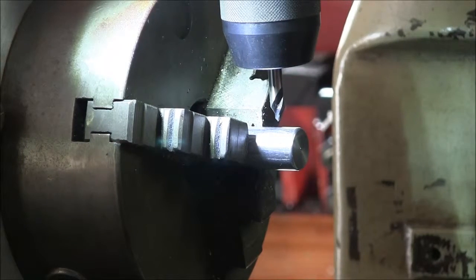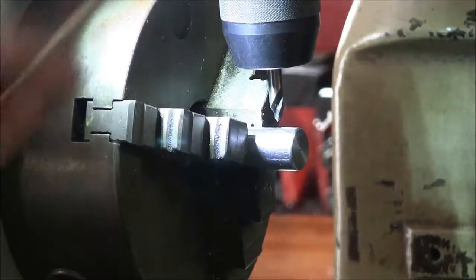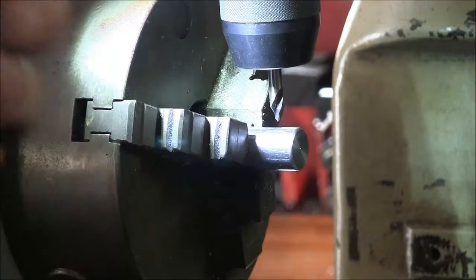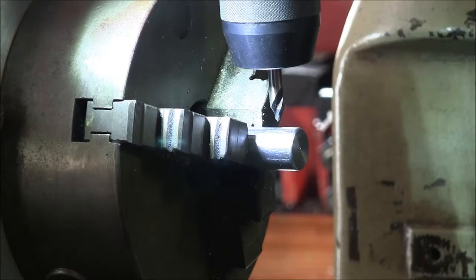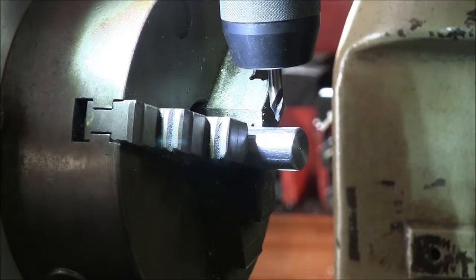Okay, we're on center. Got the drill chuck in there, got a centering drill in. I found a piece of bar stock from the junk drawer — it's 235. So I'm going to have a slight press fit on it. I got an A drill here, we'll drill it out for an A. I just came over an arbitrary amount; I'm not too concerned with that. Here we go.